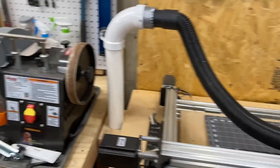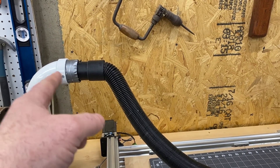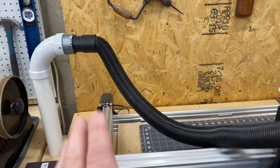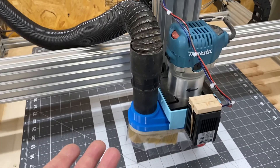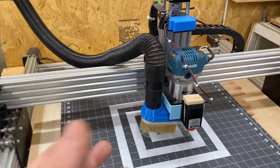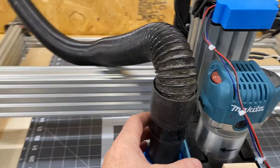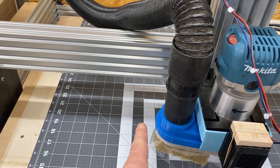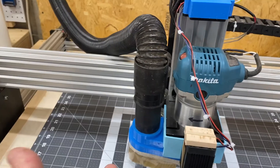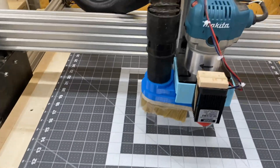The suction power out of this is approximately 175 CFM, cut down just a tad through the reducing area. But the flow from a wet vac is far superior to that of a dust collector. I do have a two-horsepower dust collector, but it would require a big hose suspended up top to keep stress off the Z-axis, plus a large reducer that would take up clearance. With this setup I have no such problem.